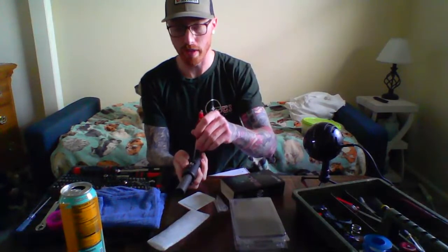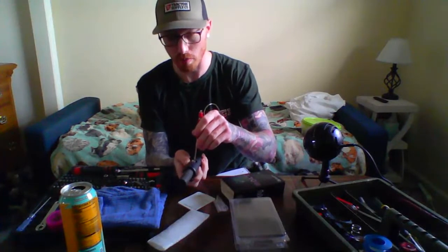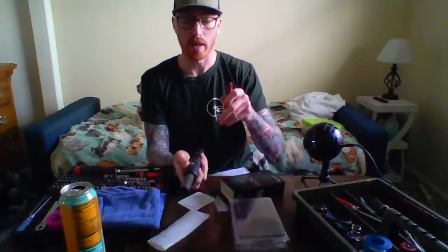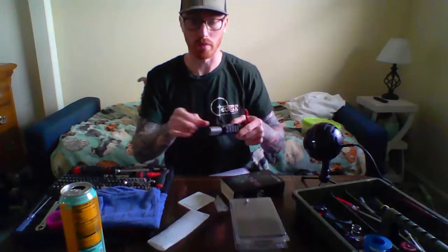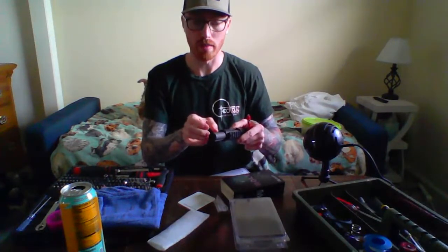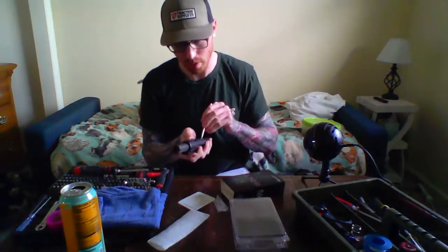When you drill the fitting hole close to the front threaded hole for the body bolt, you're probably going to have to dremel the stock a little bit because the airline might hit the molded piece in the stock. You can just kind of dremel that away — you can fix anything with a dremel, honestly.